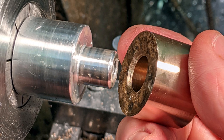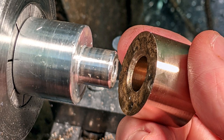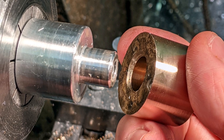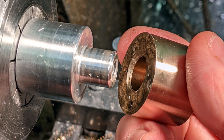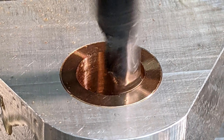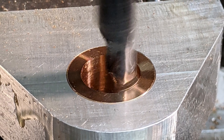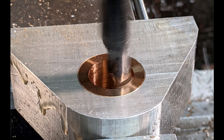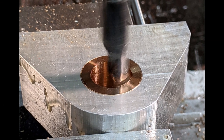It was a bit green with verdigris, but I chopped it up with a bandsaw, drilled and reamed a centre hole, turned a mandrel with an M6 tapped hole to clamp it in place for turning, and set about machining the outside diameter to fit the bore holes in the bearing carriers. Once it was turned to size and faced, I made three more bushes from the rest of the bronze, keeping just a small piece as a memento.